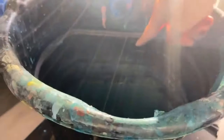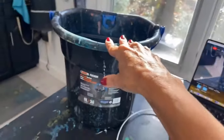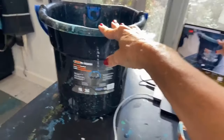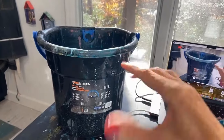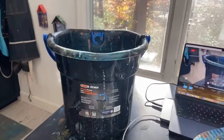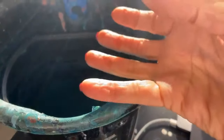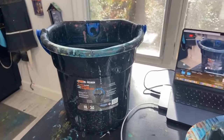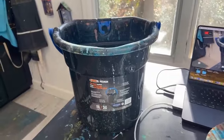I get a lovely color in my wastewater. I wait till it gets pretty much halfway full. Then I take this bucket outside — I've got two five-gallon buckets right next to my trash can and they've got about five inches of playground sand in each bucket. I pour this into the larger five-gallon bucket and then I allow nature to do its work. The sun and the environment will actually evaporate all of this paint water into the sand. Once all the water is evaporated, I can take that sand with the dried paint and it will just be a solid mass and I can throw that safely in the trash.